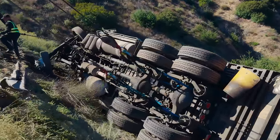As you guys can see, the rotators are put away. And look, that cop was nice enough to give us this extra lane, even though the fire department left. We didn't need it, but hey, we don't often get lane closures, so I'll run with it. That was cool to have, just for the peace of mind. Ricardo's doing a Frankenstein tow. Go underneath the frame out, and then you use your chain fork receivers. You're gonna put the pin on the inside so they don't slide, keeps it nice and tight.